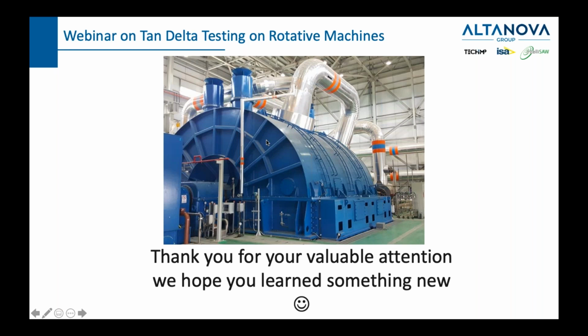Is the acceptance criteria for the insulation subjected to environmental aging like radiation and thermal defined in any standard? Well, as much as I know, no, but we can additionally check on that. And if we run into something which talks about radiation, as we saw before, we'll let you know. But for gamma radiation, you can send us an email just to understand what the quantities of this gamma radiation are, because if they're very big, then probably you have even more experience than me on how it affects the electrical insulation.